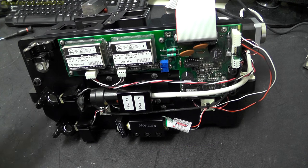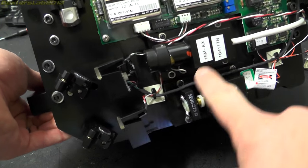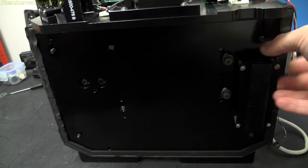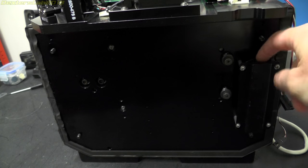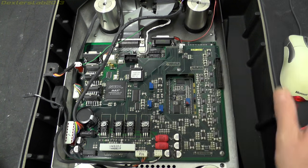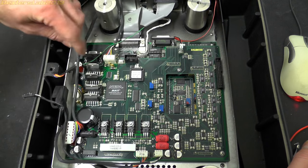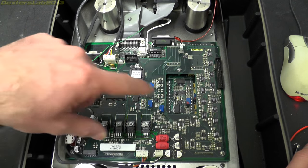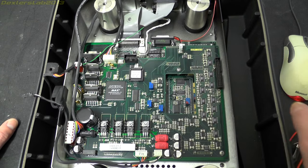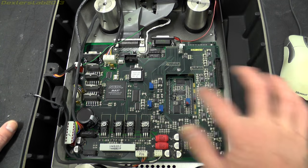So we've just got the main assembly here. You can see now the two lasers — that's the red one, the green one just there — and the optical paths. Underneath there's very little, just this stepper motor covered by this piece of metal with a belt drive. In here we've got the two main PCBs which run the whole show. The main power runs into this connector here which supplies power to both the top and bottom board. They are connected together with a few pin headers placed in a couple of places around the PCB. On this top board we've got a number of adjustment pots.